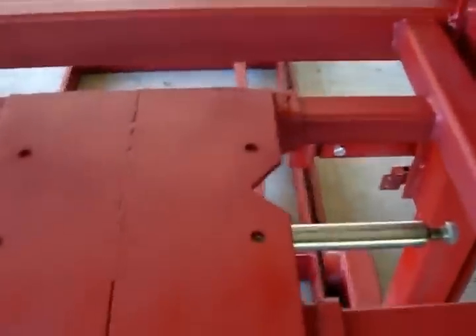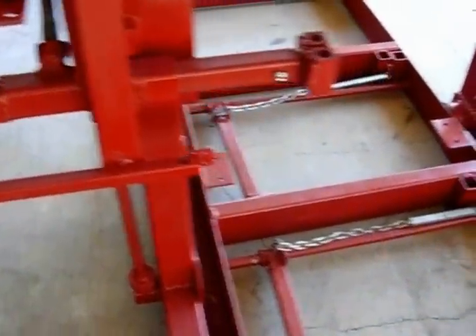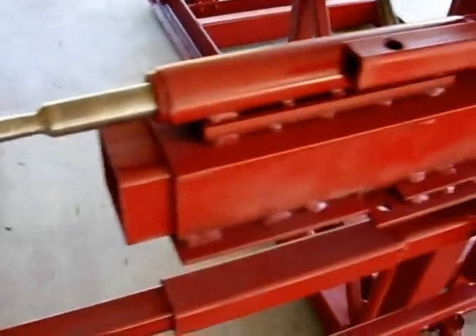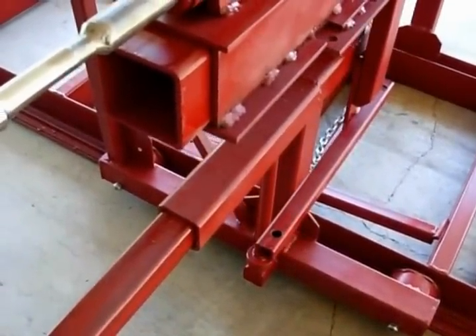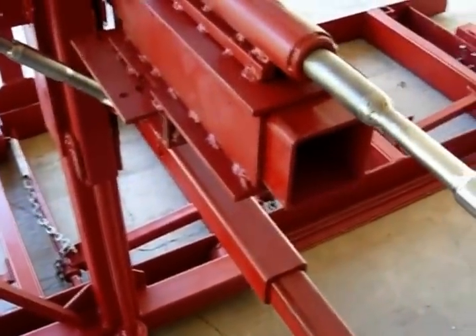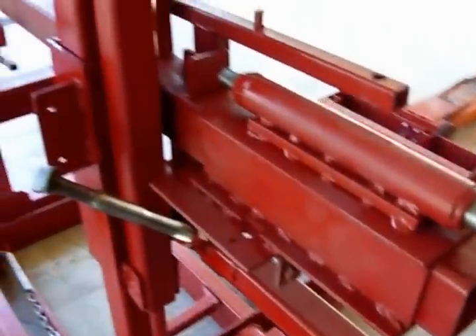Now the motor engine mount - here's a chance to look at it. It slides back and forth on these tubing and has a shaft here to slide on. Here we have the bandsaw blade guide that goes in and out. On the top here is the idler wheel adjustment, and again it's a box - here you can see how the box is for going up and down. It's just made over the tubing with a little spacer. I use 20 gauge - probably use 16 gauge metal - and space that on two sides and you'll have plenty of slippage and it'll still be pretty sturdy.